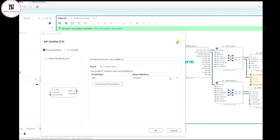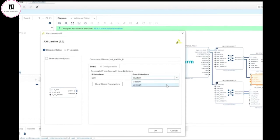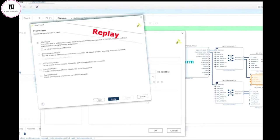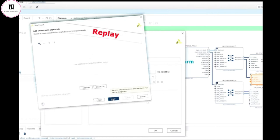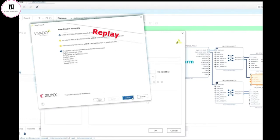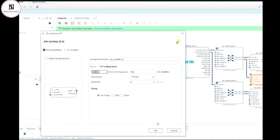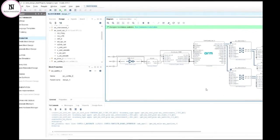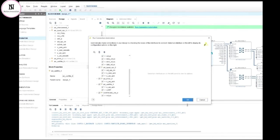You can see that at the same time as setting the baud rate, I am going to set the UART to be connected to the USB UART port on the ARTY development board. It's worth noting that the block diagram editor is board-aware, and because I selected the ARTY board when I created the Vivado project, it knows that there is a USB UART port available on that board. The same is true for the quad SPI controller peripheral — it's board-aware, and therefore it knows to connect the correct signals to the flash component on the board. We now have quite a lot of unconnected clock and reset signals stacking up, along with the PCB connections for the UART. I can use the connection automation wizard from the green bar at the top of the screen to connect everything together automatically, and very quickly the system is coming together with minimal user effort.